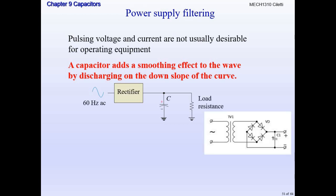All right, so when you see this schematic on a test, this is on the Siemens test question as well. That's a full-wave rectifier that you see there. You see the transformer? There's a transformer on the left-hand side, that tilde means AC. And then you have four diodes, kind of making that diamond piece. Okay, remember what diodes do: they control the direction of current.